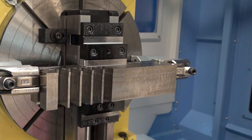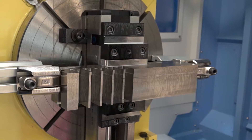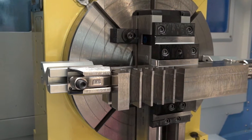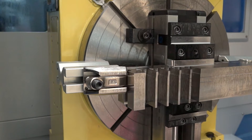What materials are we looking at? This is obviously Ti-6Al-4V titanium, but what else? Inconels, and any specialist hard material — that's really what it's geared for. Does it predict tool breakage, or maybe tell you the tool is wearing so a change is imminent? It will predict a breakage; it won't let the tool break — and that's another reason to use Force.